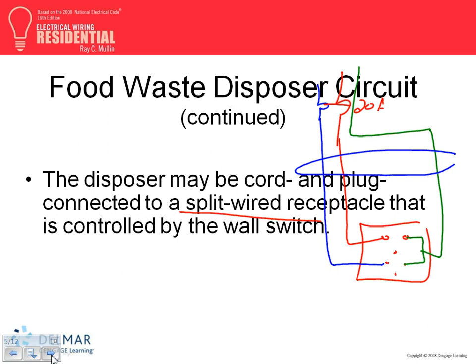That will give me a split circuit receptacle, right? There's a copper piece between these two; you cut it and split the receptacle, meaning the bottom and the top will each be a 20 amp circuit, right? This has to be from hot one, and this has to be, can this be from hot one again? It has to be from two. In three phase, if one is phase A, the second one must be from phase B. Otherwise, you're defeating the purpose.